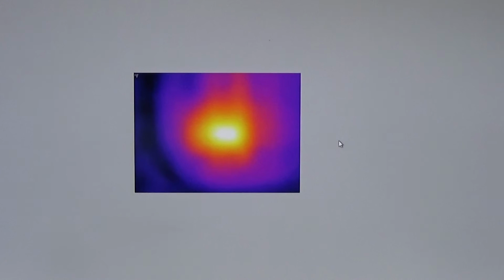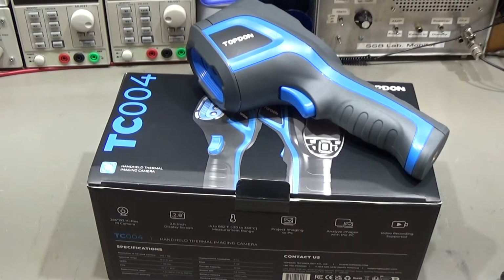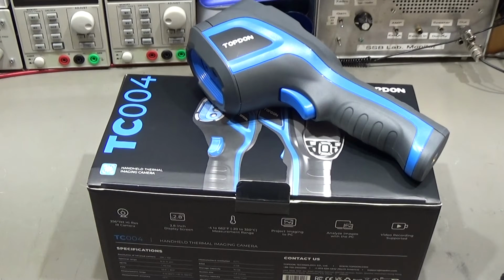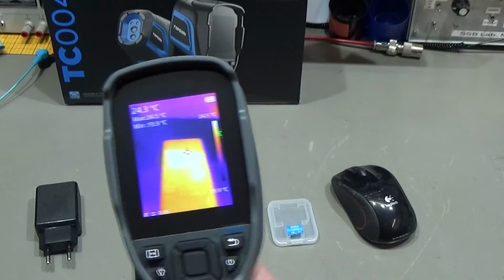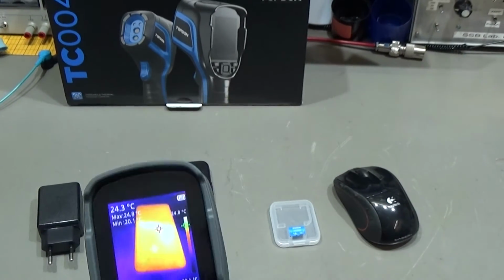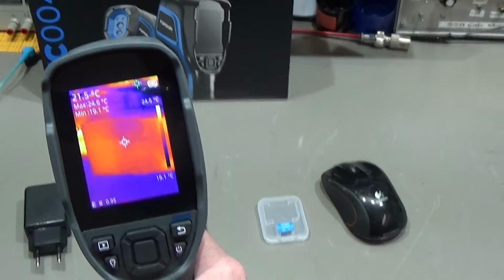That might be an early picture here, low resolution and a bad NETD, and you do not really know what you're looking at. It is blurry, and that was not really helpful. Today all of that becomes much better, and not only very expensive cameras have such good features. Well, the very next one on our list is for sure the frame rate, and that is, you know, the update rate that our camera is able to deliver.